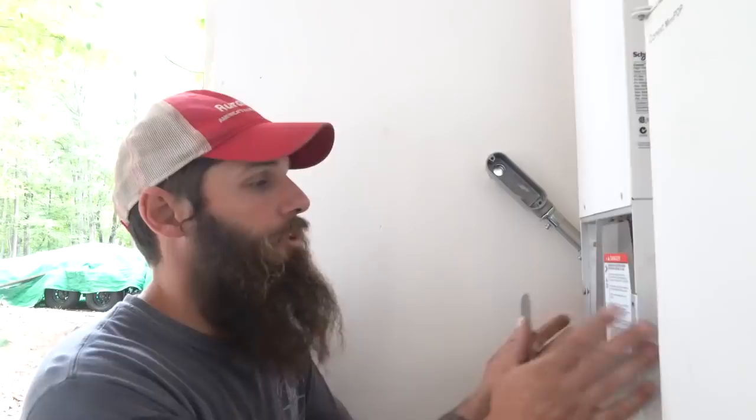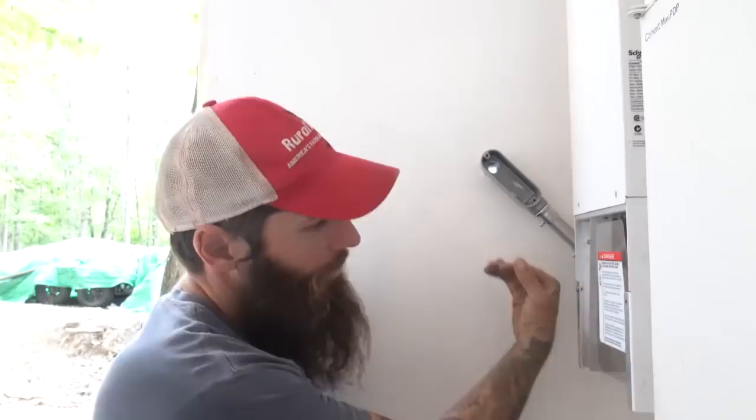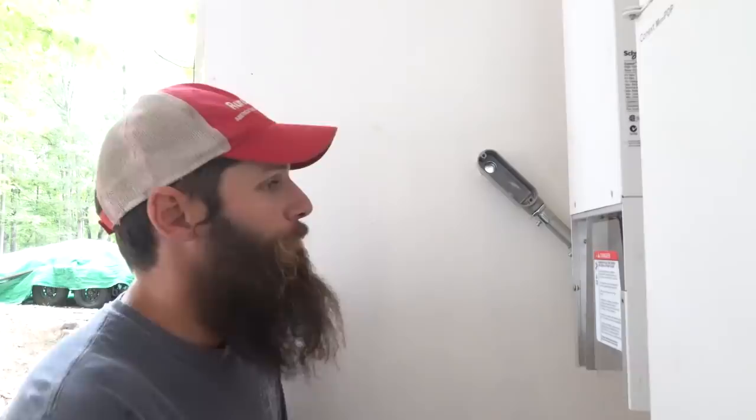So we got our conduits up and installed. The cover will come off, we'll push the wire through the conduits, come into the charge controller, and the cover will go back on. I'm not a big fan of the way I had to install it like this, coming down at an angle and coming in. Typically I do everything parallel and perpendicular. In this case, it's all laid out coming through the disconnect. It wasn't that easy.